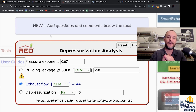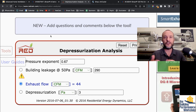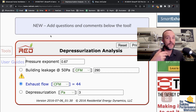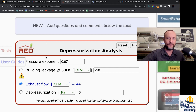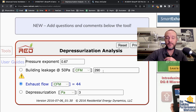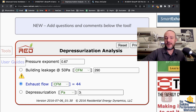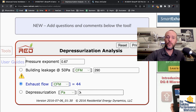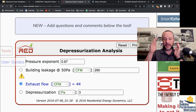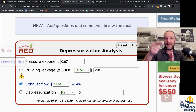That's 25 CFM from each shower, 15 CFM from each toilet. Zender talks about 20 CFM from either a toilet or a shower, but I think it's strange to treat both those things the same way — they're very different in the amount of pollution they'd give to the home. This is called the Depressurization Analysis Tool from RedCalc — it's free to use. So let's do my house: a blower door test of 290, which is my home's blower door test, for 47,000 cubic feet of air within my 3,000 square foot home. To pressurize the home to three pascals, we're going to need 44 CFM of unbalanced — 44 more CFM coming in than going out. If my exhaust is 120, then my supply has to be 164, which I can't do with that 150 CFM ERV.